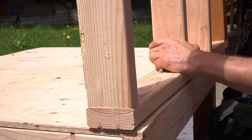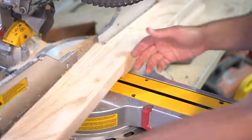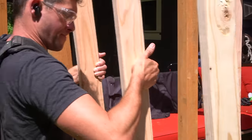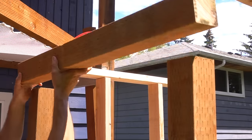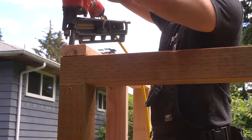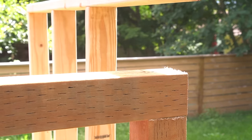I tipped the first wall up, positioned it appropriately on the side of our base, and then secured it to the base with three-inch long screws. I then cut my lumber at the appropriate size for the second taller wall, which is six inches taller than the first side. Just remember that the 4x4 post at the doorway has to be the same height as the smaller side because it still needs to be aligned with our header. Once I have this second wall secured to our base, I then proceed to installing our header that connects both walls together. This is a very important step because we want to make sure this is perfectly square — we will have a door opening at this location, and if it's not square, it's going to make it a lot harder to install a door. In order to secure the header to our framework, I used six-inch long screws, but make sure you have those on hand.